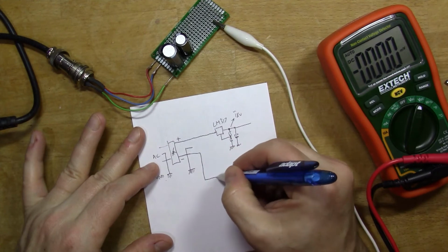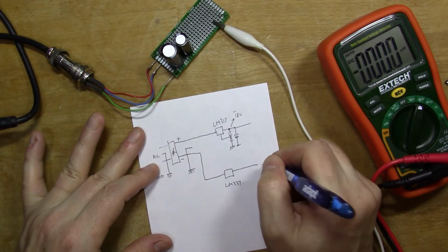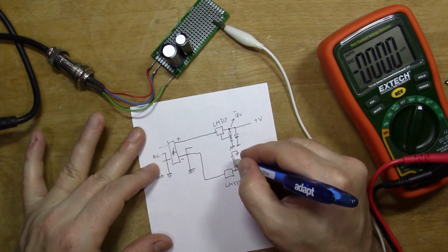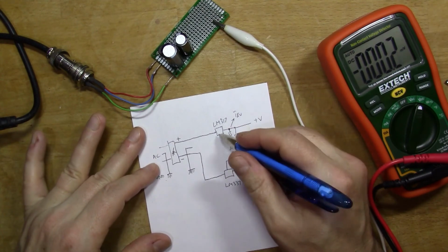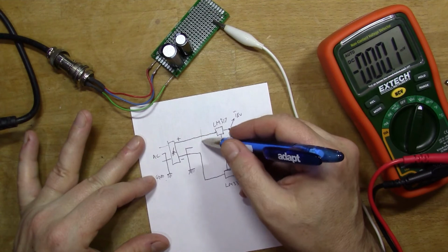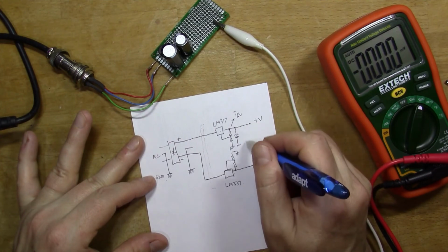And then on the negative side, you get the sort of mirror replica. So there's a chip called the LM337, which is the negative version of the same thing. So you got a negative voltage coming out of here, and so the LM337 you connect up in the same way. That's connected to ground there, but then this is giving a negative voltage relative to ground, so you need a different chip for that, but it works more or less in the same way. The pins are confusingly a different way around, but it basically works in the same way. So that's what I'm going to do basically. So you got unregulated DC on this side here, and then after the 317, 337 stage, we'll have a stabilized regulated voltage on this side.